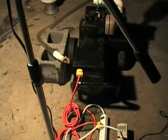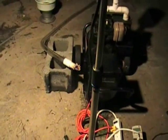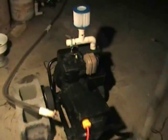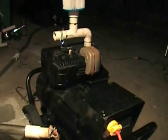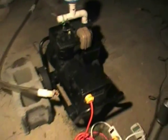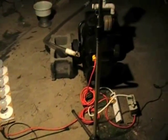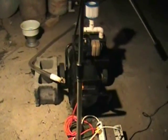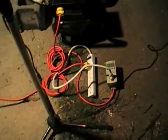When I do the wood gas test again, I'm going to try something different. I'm going to put a small turbo fan in series with the output of the gasifier so that the generator doesn't see a lot of back resistance. I want to see if I can bring the power up under load. I'm just going to experiment. But with all that said, I'm going to put this camera on the tripod, crank this thing up, burn this bag of gas out, take some temperature measurements on the engine, and take some frequency and voltage measurements so I can compare them to the wood gas. Let's get started.